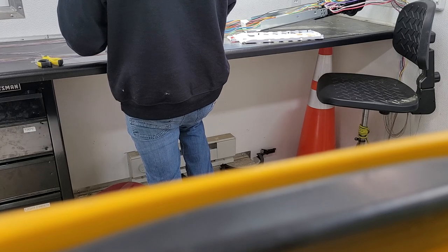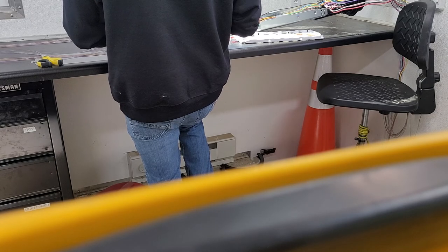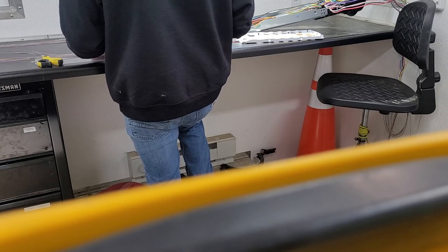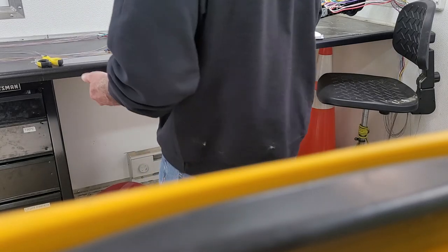Same thing goes for a bucket truck. Fortunately, when you're doing that kind of work, the fiber itself might not be that dangerous, but everything you're around to put it, install it, and get it around is very dangerous. You've got power 36 to 48 inches underground, and it's about 10 foot or so from the comms lines usually, on the aerial. And again, if somebody doesn't know what they're doing, they could accidentally get lit up or get somebody else lit up.